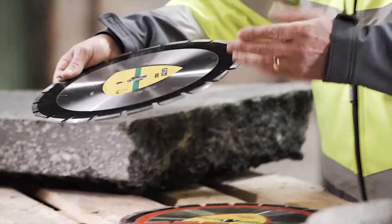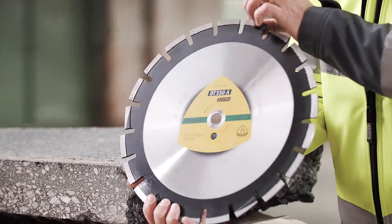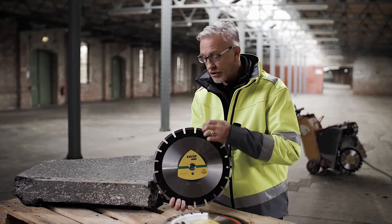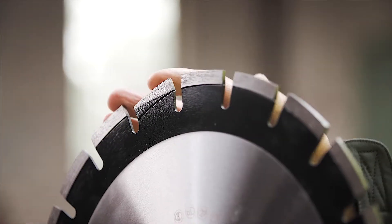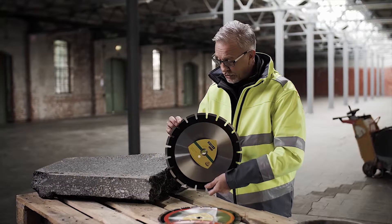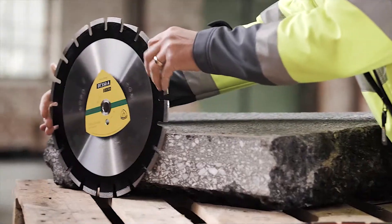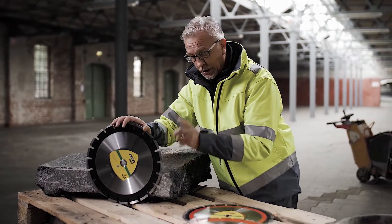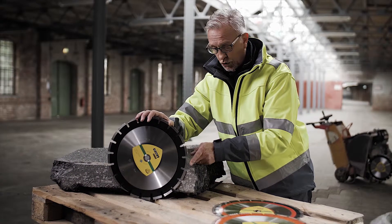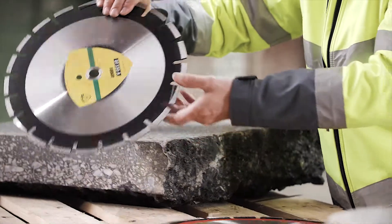Let's have a look at the types of product that we can use. Let's have a look at the construction and design of a diamond tool developed especially for this abrasive material like asphalt. Here we have a diamond wheel with a metal matrix made of a very, very hard metal matrix to withstand these abrasive properties while cutting through asphalt. In addition to the very hard segment, we also have the inclusion of safety segments. These safety segments serve a major purpose in protecting the steel core. When the diamond wheel is rotating through the asphalt, we get a lot of undercutting, which causes damage to the steel core — and if we create wear there, you can get the diamond segment breaking out prematurely. So these safety segments prevent that from happening, making them a crucial component when working on extremely abrasive material like asphalt.